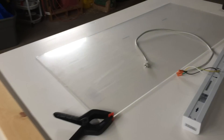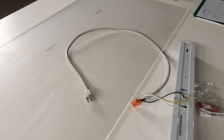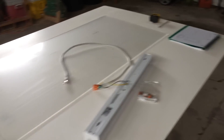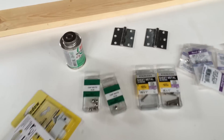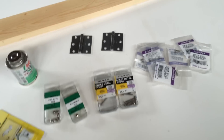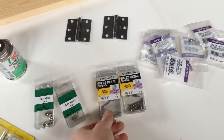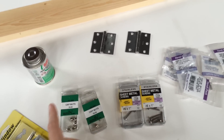And then we've got the acrylic. This is quarter inch acrylic, and we're going to cut this with a saber saw. And then to actually put this together, we've got PVC glue. This is just your standard heavy duty clear PVC cement. And screws. Because this is a half inch thick PVC, you can actually use one inch sheet metal screws to hold it together in addition to the PVC glue. So we're going to be doing both.